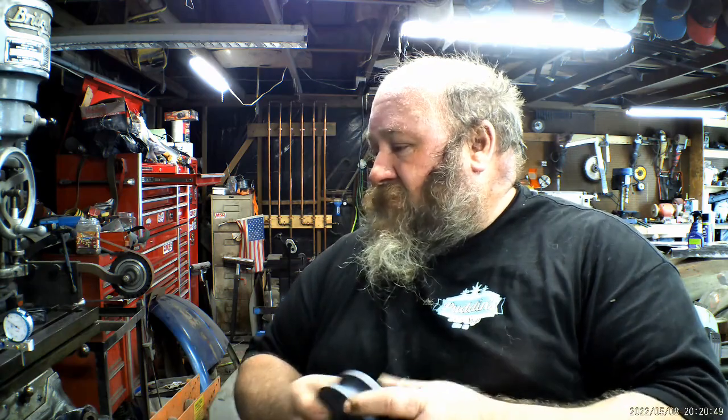I had intended on going to time-lapse, but it turns out I've only got one battery for this camera. So I got most of the rust off except for in the places where there are the scraping marks, which are lower than the level of the mill table. We can check this table for flatness, and we may do that, but I expect it would need to get a whole lot better. There are some deep gouges down on this end, and to fix those we'd have to pull it out and have it ground flat with a surface grinder.